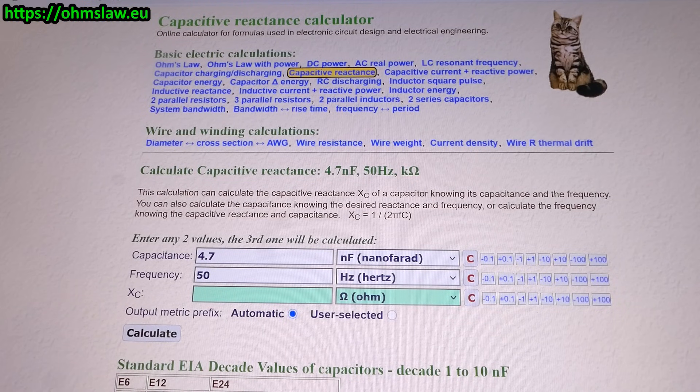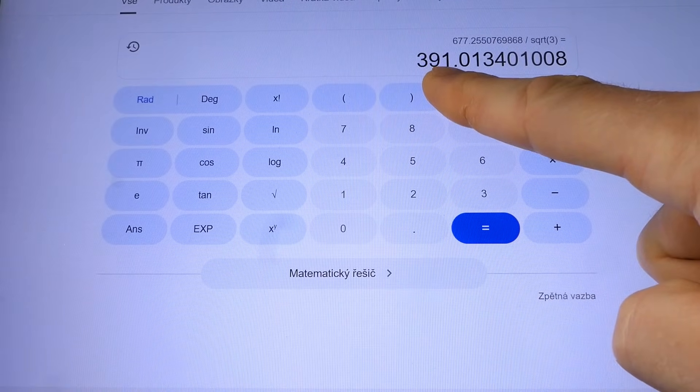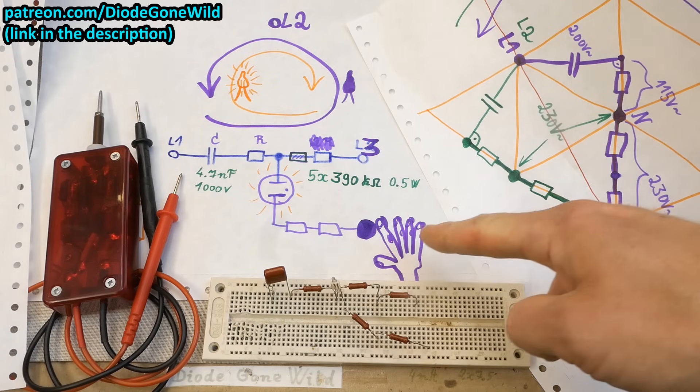There's no black magic in calculating the resistor from the capacitor. In my calculator you get the capacitive reactance from the capacitance and frequency. You divide that by √3 because the voltage on the resistor is √3 times less than on the capacitor, so its impedance has to be √3 times less — giving about 390 kΩ. So that's my exhausting video about phase sequence testers. If you've made it this far, please consider subscribing, supporting on Patreon, or using the thanks button — it's you who keeps this channel running. Big thanks to all who already support me.